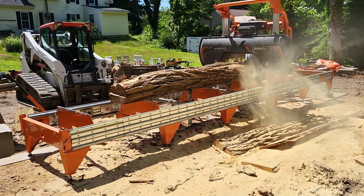So let me get this slab off, and I'm going to pause you guys 1 sec. We'll get this slab off. We're going to flip the other one over and see if we can skim it. Cool, so you can see what I got up here for planks. Really, really beautiful black locust. This is going to work out perfect for them. This one here is, I think, 2 3/4 thick. Just right around two and three quarters thick. I'm going to skim this to 2 inches and hopefully get rid of some of that inclusion right there and turn this into a decent slab. So that's the plan.